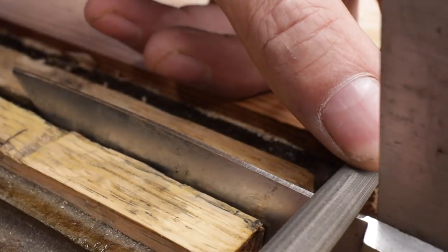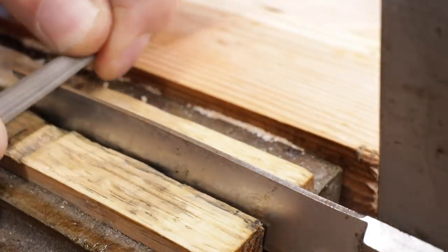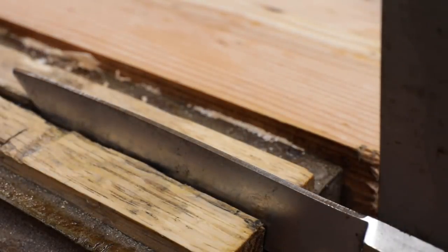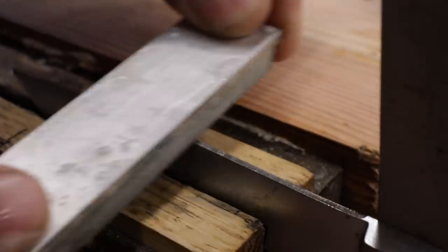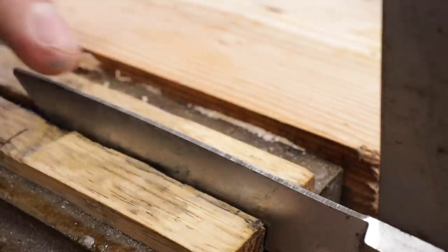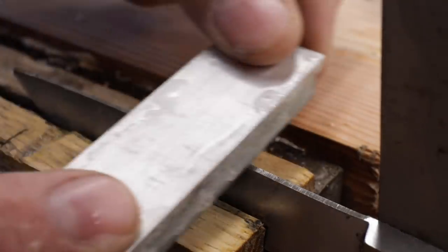You're going to ask how you maintain the angle. Well, the angle is probably correct on there already and you're just going to follow it. As you pull and clean that rust away, you'll see it. If you have scissors in pretty good shape or you're just re-sharpening something you've already done, a small handheld stone works really good. These little guys — you can get them on Amazon — they're very controllable. This is a thousand-grit here. We can just go and polish, looking at that rust. These have probably never been hand-sharpened, because the flat stone is revealing deep machine marks — probably sharpened on a grinder originally. You can do better with a fine stone like that.